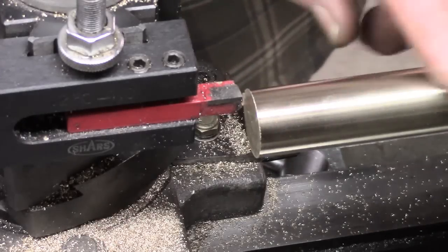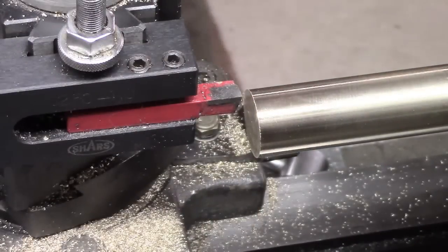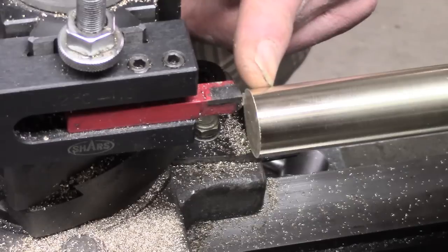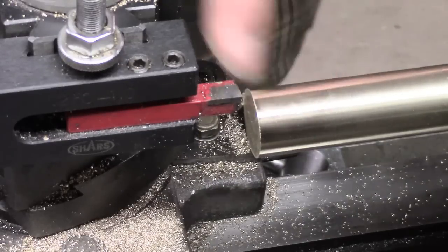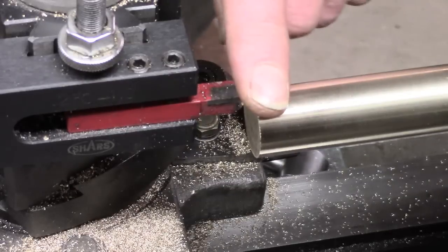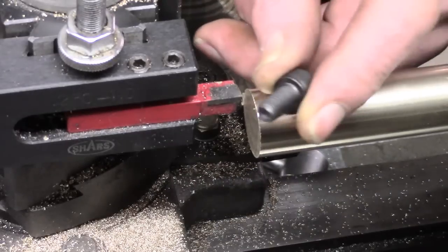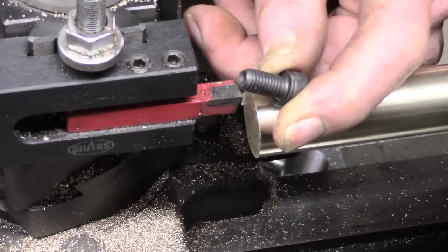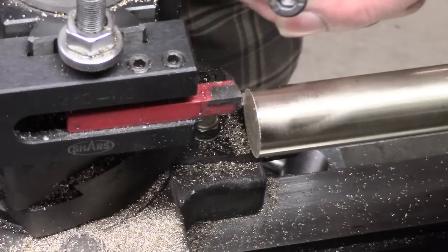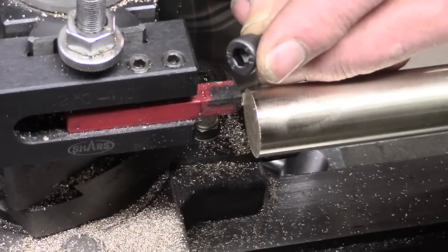Right, I've cut this off. I've left out something like three and a quarter, and allowing for parting off, I'm after one, two, three, four, five, six pieces. And if this is rigid enough, I can probably put a centre in when I part off. But I've got to bore this out - clearance for an 8mm. And then each of the discs will have a milled recess for the head, which we've got to machine eccentric. We'll come to that later.